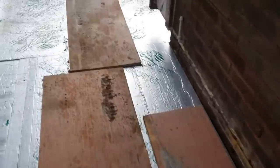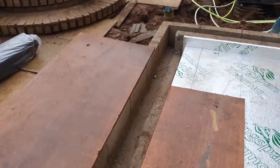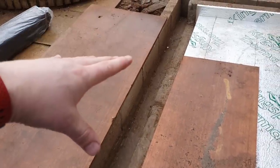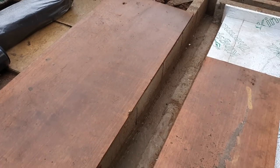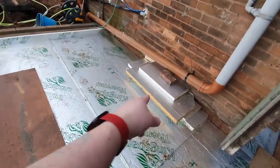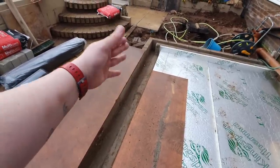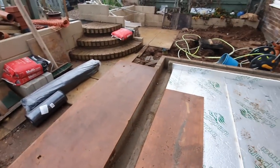We need a little bit for where the back door's coming out. On the back I realised we've not done returns for the back door, and we're not sure whether we're going to put a normal back door in or French doors. I was going to knock three blocks out to have like a 1,200mm wide French door but it loosened two others, so I took the whole row out, chipped the concrete off the bottom, and we're going to bed them in again with cement and put the reveals in. Then we'll stick what's left of the insulation in there, and we've got insulation going all the way up to under the door to the front of the building with no cold spots. I can put this little cold bridging bit all the way up to the door.